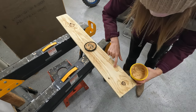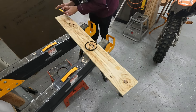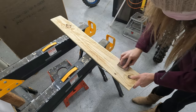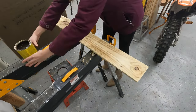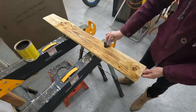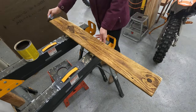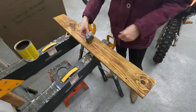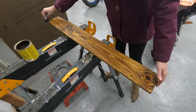Now we have the piece we want, so let's make it pretty. I'm going to start by filling the previous nail holes with a bit of stainable wood filler. After scraping off the excess and letting it dry, I sanded the filler down until I once again had a nice smooth surface. Then I'm going to stain everything. I'm using my go-to color, which is Varathane's Early American, wiping it on every surface with a lint-free cloth. This is a rich, medium wood color that makes basic pine boards look awesome. I let it soak in for a minute and then came back to do a second coat to darken it up just a little more.